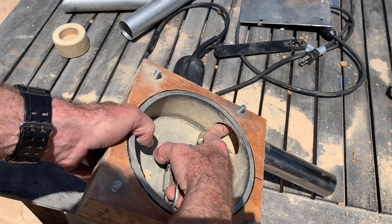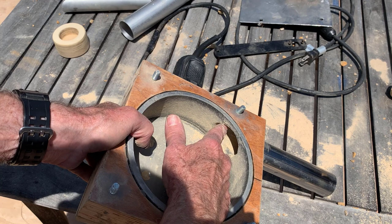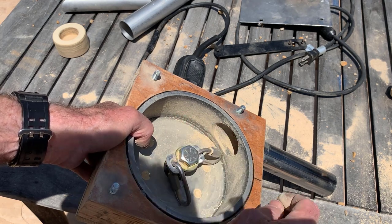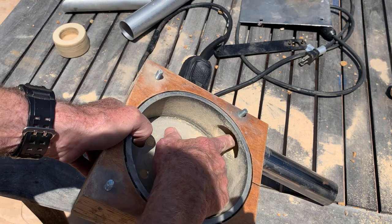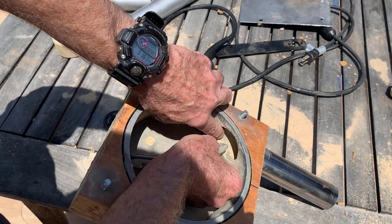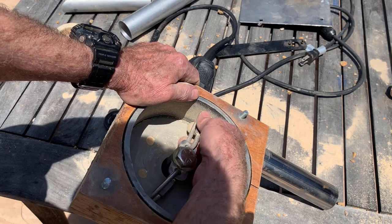There's the end of that pipe that's been shaped. I cut the hole in here, which is kind of a laborious task. I just drilled a bunch of holes around the shape I wanted and then used a file to clean it up. The whole thing took maybe half an hour to get that hole perfect. The rocks slam against this side because of the action of the flail. That's why I wanted it to be steel and not aluminum. I've run 5 kilos more or less through this and everything is fine so far.